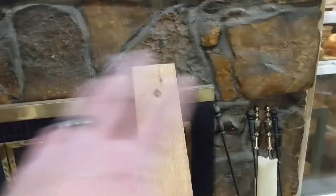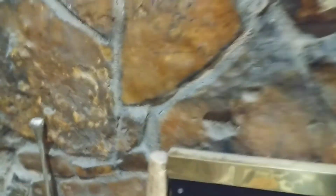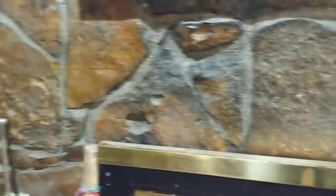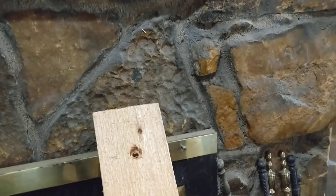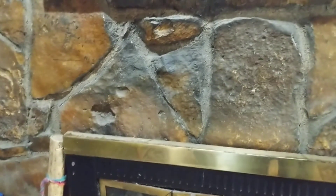This is the spot where I'm going to put it. I put my board up on there, put the long level on there, found my marks and reference points. After I drilled these holes, I held my board back up and made a reference point for one of my holes. I'm going to drill that one first, stick the bolt in, hold the board on there, re-level, make sure it's right, and then mark the other hole. That should make it a lot more level that way.